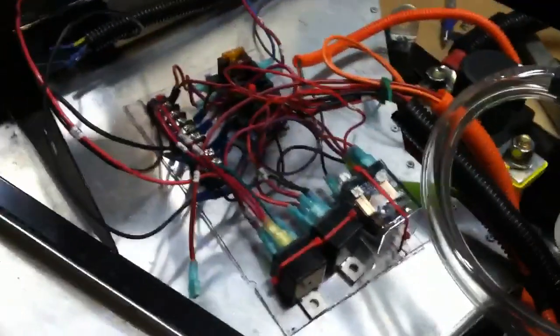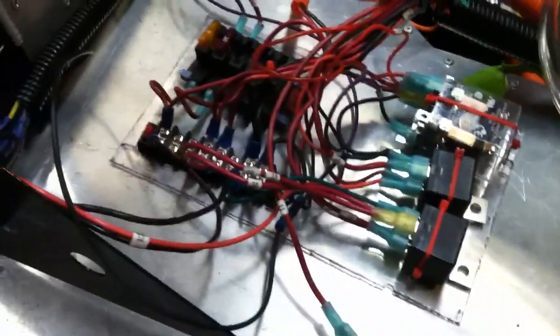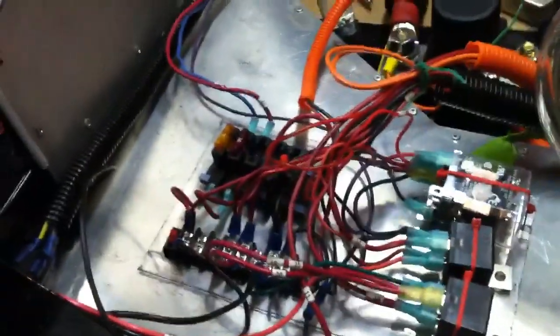I've added a little bit more wiring over here where these relays are. This little board is pretty much finished for the moment. It's going to control all the contactors — the forward and reverse contactors — as well as relays to control the pump motor down here to run liquid cooling through the system, the blower down there, and also to run the fans on the radiator. So the fans are all hooked up, wired in, and contained pretty much now, ready to go.